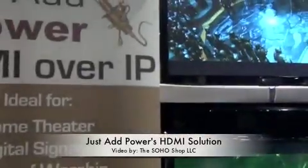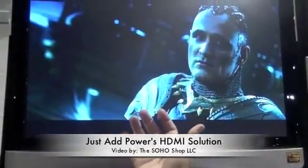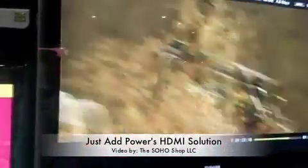I've got some other screens here that are 1080p, but this can only handle 60 frames per second. A 24 frames per second signal makes it die, but my scaler fixes that. Other screens can handle 24 and get 24 frames per second.